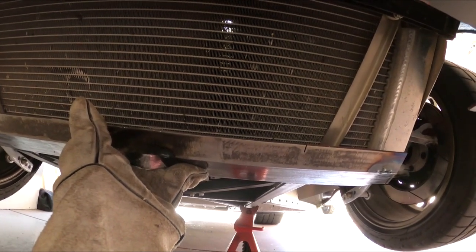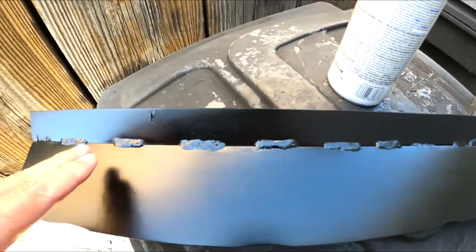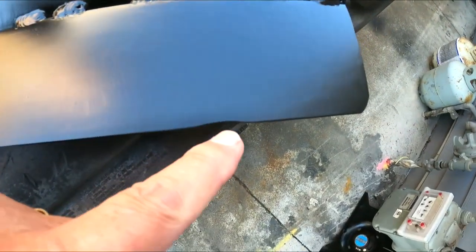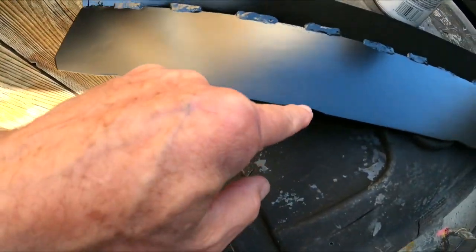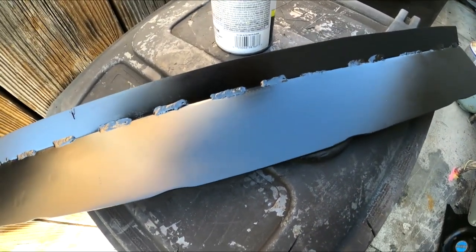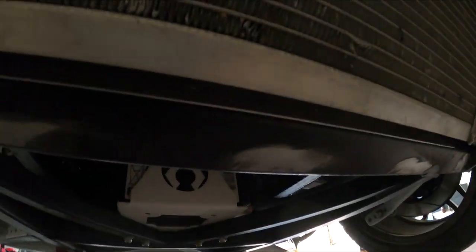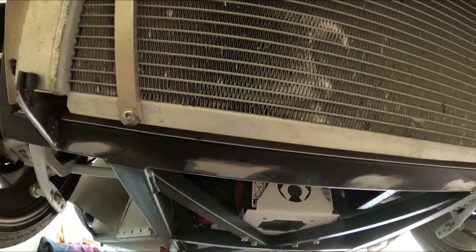The plate is now welded up. You can see welds along the back side — it's welded pretty solid on the other side too. I'll flip it over, get another coat of paint on, then clean the paint off the edges. I've done a recess here — I'm going to stitch weld here, here, here, and all down this side so moisture can get out. I want to make sure water can't sit in this area. Plenty of drainage. We'll flip this over, paint the other side, clean up the weld areas on the chassis — can't weld through paint.